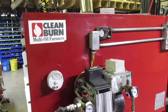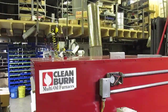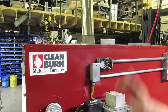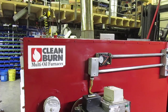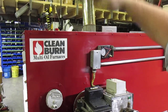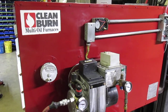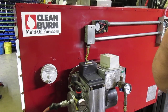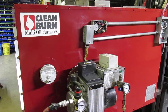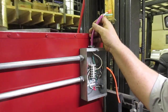The fourth category is practical installation guidelines. On top of the heater you want to have two to three feet for fire safety — three feet all around the furnace in all directions so you can clean and service the burner. It also needs to be eight feet up off the ground for code. Do not store flammables in the area of the heater, such as gasoline, hay, or cardboard boxes. On the power cable, be sure you use sufficient size wire so it doesn't get hot.